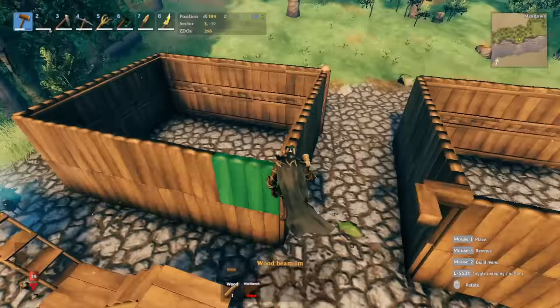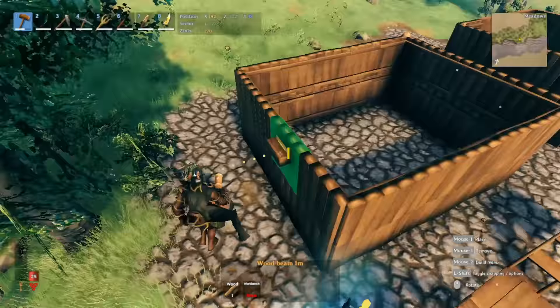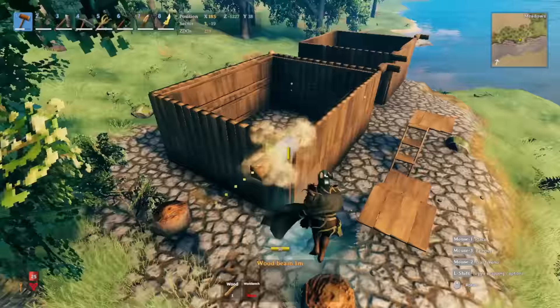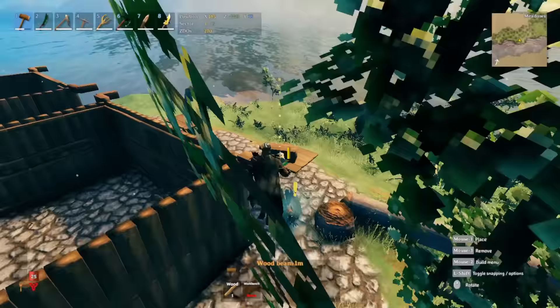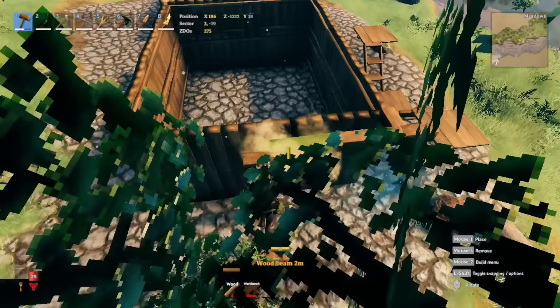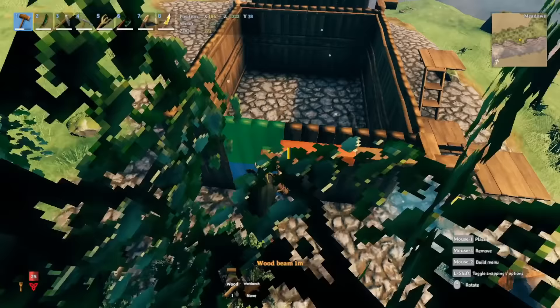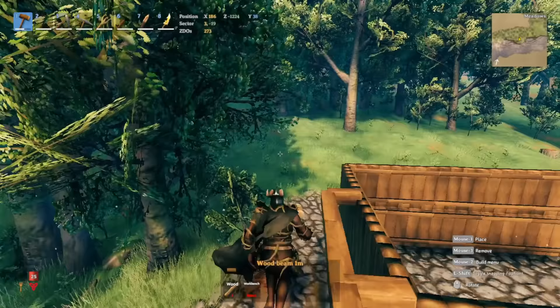I use a one-meter wood piece placed to the side, pushing out, and then one more pushing to the front. I do this on the same side and basically start it off right there. Whenever you carry this wood across to the side to support the remainder of the roof, every two two-meter wood pieces you place, you put another one-meter wood to support it.